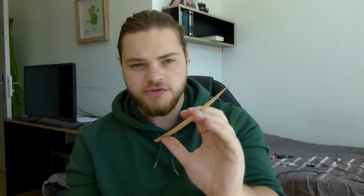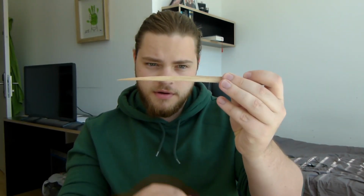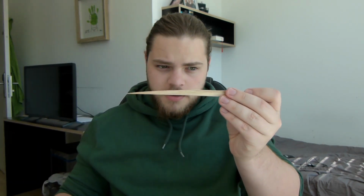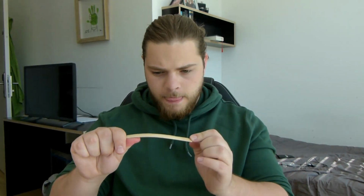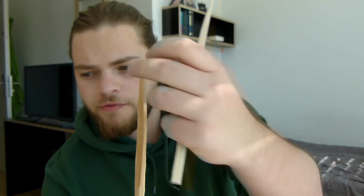With this piece of wood, I was trying something else, but you can see the weird shape. When I was trying to trim down the sides, I cut into it like that. With this one, it's actually really good. I cut with the grain instead of against it. Another mistake I made in a lot of my bows was that they all had grains of wood that ran off the sides, and whenever I tried to make it, it would just snap like that.